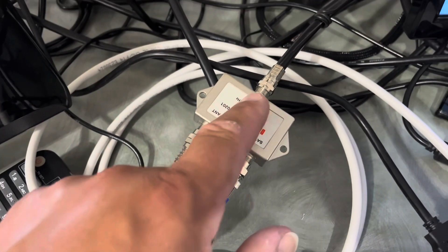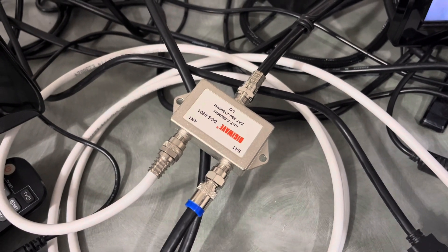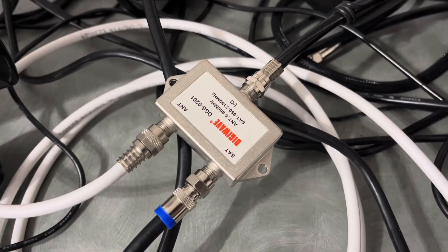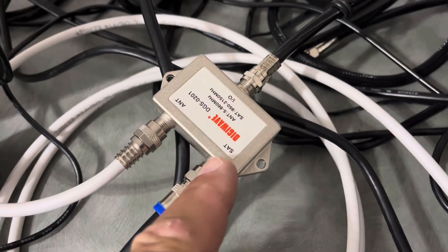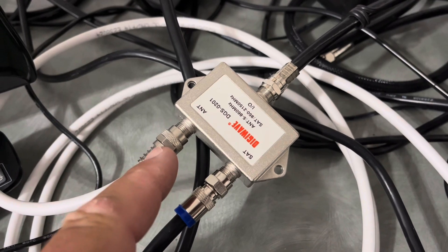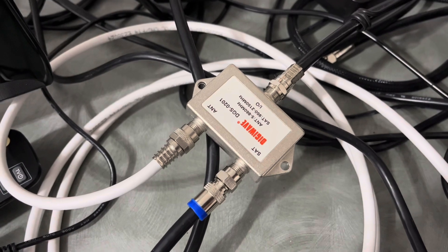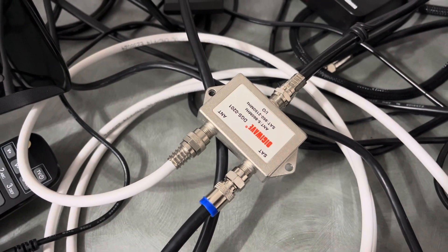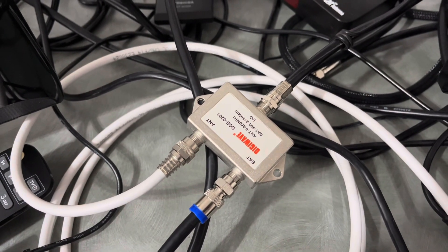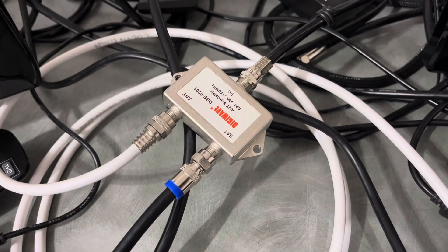Because this is an input/output, the voltage from your satellite TV receiver will continue to flow back out through this cable to the satellite dish LNB to allow for horizontal and vertical polarization switching of channels. Generally speaking, the DC voltage power pass is usually only on the satellite side of these combiners. If you have a TV antenna that has a preamp that also requires DC voltage power passing, you'll probably have to run a separate coax cable for your antenna — in that case, you would not use this combiner system; just run separate cables.